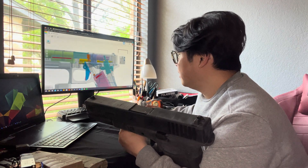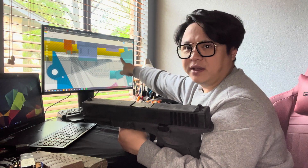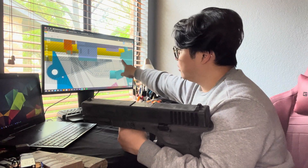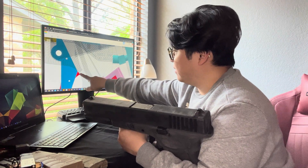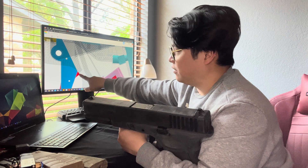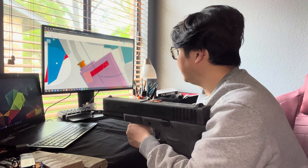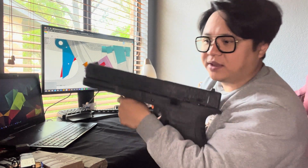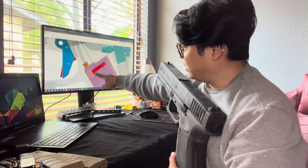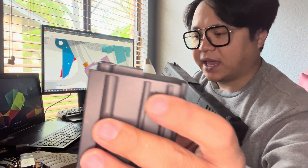You can see the trigger right here. This channel is where the trigger bar goes to the solenoid valve's mechanical switch. The trigger bar is right here — I had to design this so it hits the frame when you pull the trigger, just like a regular Glock. Here's the M4 mag with the M4 mag release. Normal Glocks have a release right here as well — I just put an extension bar to go to the back so it can catch the M4 mag's mag catch.